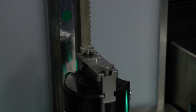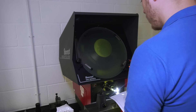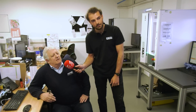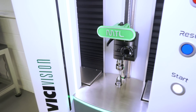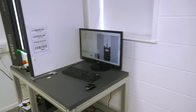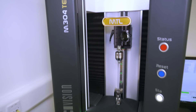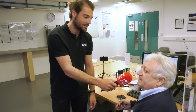You've got the two Vici optical inspection systems and a shadow graph working in tandem. Where does the shadow graph still have its place? What are the benefits of optical inspection over manual shadow graph? Time - so you get better accuracy and also a quicker cycle time. We still use the shadow graph for internals because you can look inside where you can't on the Vici machines. But you get a much quicker cycle time on the outer diameters and external features. There's one part where there are 127 features to be measured and the Vici does it in around 35 seconds - whereas manually it would take at least an hour.